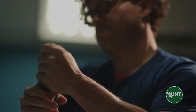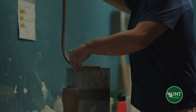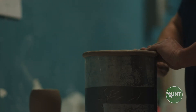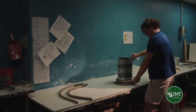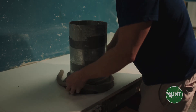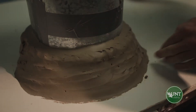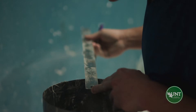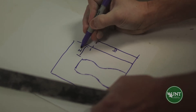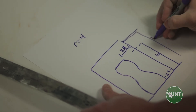Once we have our metal walls in place, we're then going to take a small coil and put it on the inside of the mold up against the metal containment walls. Then we will take larger coils and reinforce the containment walls from the outside of the form. Once we have the walls in place, we need to take detailed measurements of how far the prototype is from the metal containment walls at various heights. This is incredibly important because we will utilize these measurements as a guide when we are sawing into the plaster before we break it in half. If we saw too far, we will saw into the prototype and the mold will be useless.